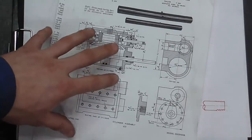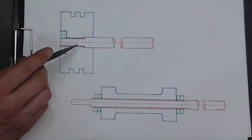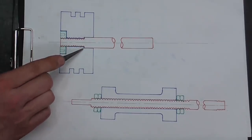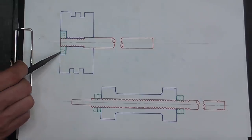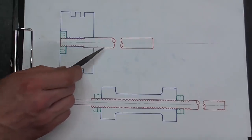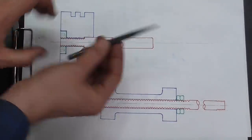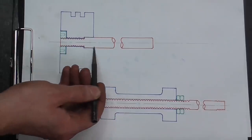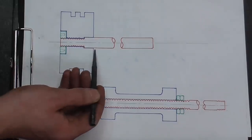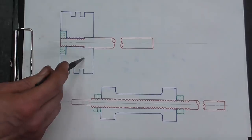So, sorry Martin Evans, but I have redesigned your piston in the following manner. I have reduced the thread diameter to a quarter inch to give me a shoulder at this section. I have added a lock nut on the back, and I have incorporated a parallel bore to accept the rod diameter, which will go a long way to ensuring concentricity between the two components. The rod winds all the way in up to the shoulder, the lock nut comes on the back to sandwich the assembly, and the parallel diameter helps align the components.